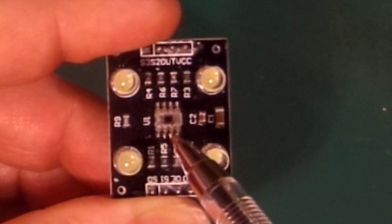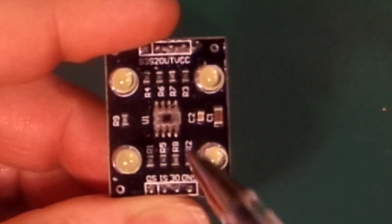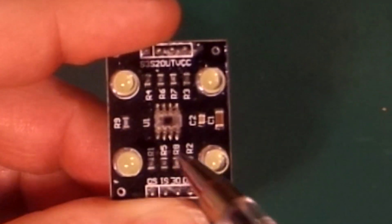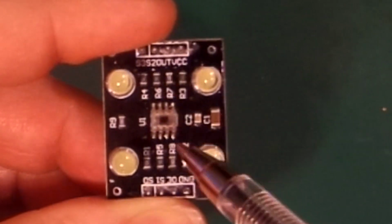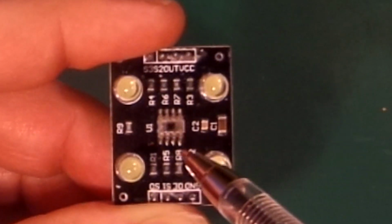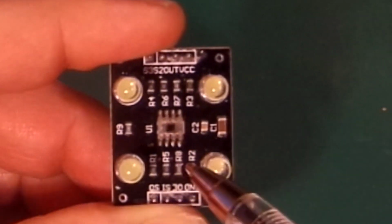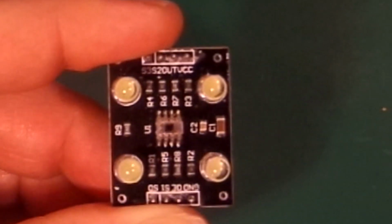Over some of them there is a red filter, over some green, and over some blue. And then there are also some without any filter at all. With that combination, they can detect different components of whatever colour they're looking at: red, green or blue. Every colour that the human eye is sensitive to is made up of different red, green and blue amounts.